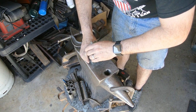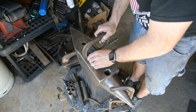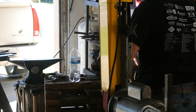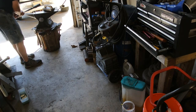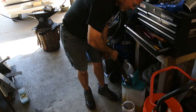For some reason this billet decided it wanted to fight me pretty much the whole way, at least when I was putting it together in the clamp. Just going to restack them after we clean those pieces up for welding again. More welding just to put the billet back together — again, these are temporary and will get cut off later. And now that it's back together, back in the kerosene.